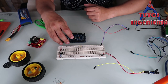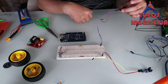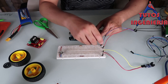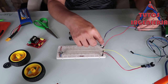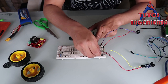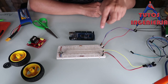We now have to connect the Arduino. We have two sensors and those encoders send signals to the Arduino, but those signals have noise. That noise is important to filter before sending to the Arduino, because that noise makes the program not work correctly. The connection is only to connect a capacitor between the signal and ground.